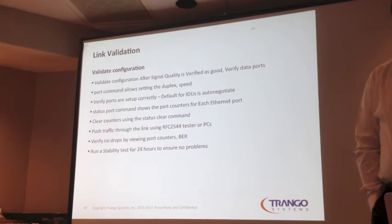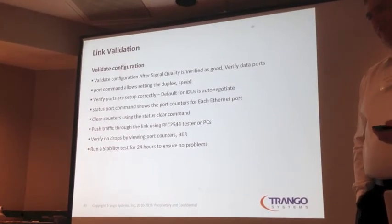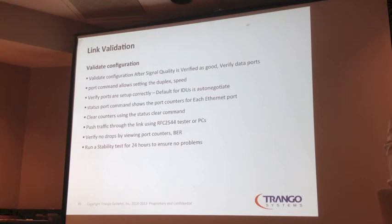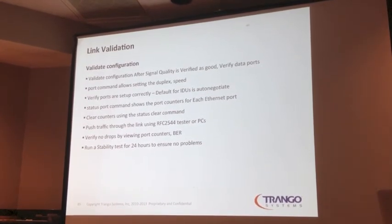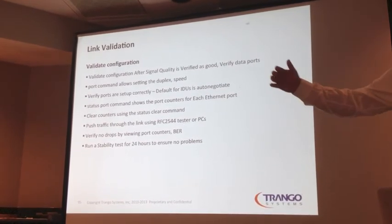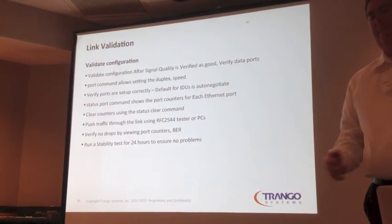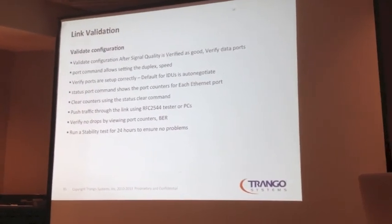That's the problem in life, actually, is that we've built larger and larger and larger buffers into products, which is, in my personal opinion, the worst thing we could have done. TCP traffic is made around dropping a packet. It's the whole way the window size works. So they keep increasing the window size until it drops, and then it'll decrease the window size, and then it's going to keep increasing the window size until it drops a packet. The problem when we buffer packets is we don't drop them.